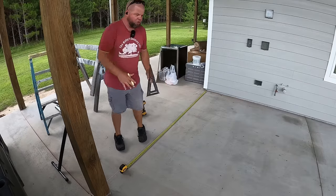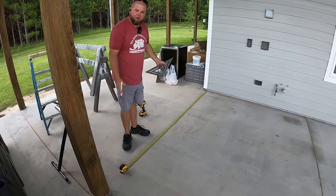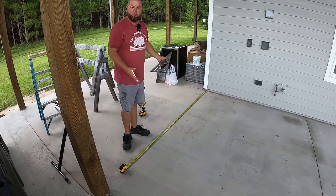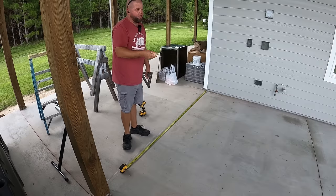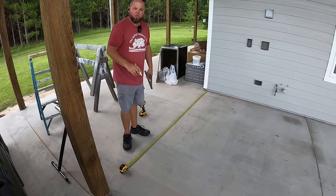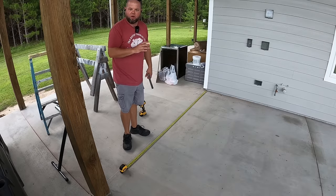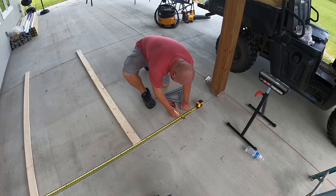So my plan is to lay the cabinets out in even measurements, like 8 foot here. It'll utilize 8 foot paneling, 8 foot material perfectly, 8 foot lumber, 2x material, and 10 foot that direction. And I bought the majority of everything in 10 foot, minus the paneling that I still have to go back and get. So this will help with cost, overall layout, and just kind of get things where we think they need to be.